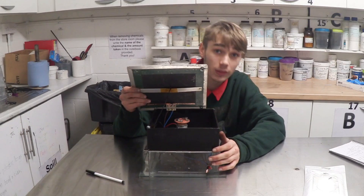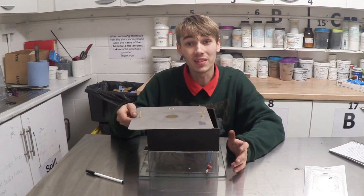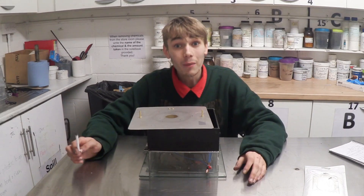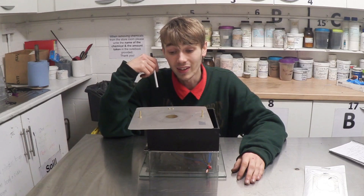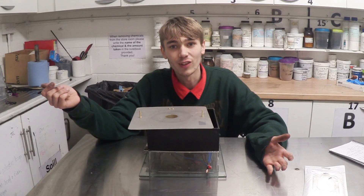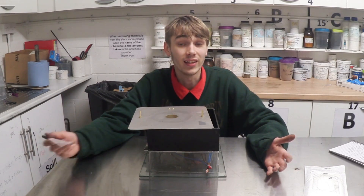That's basically what the heat plate looks like. All it's made out of is a couple of pieces of copper tape and a little bit of resistive ink. Bear in mind that this can heat up to 120 degrees pretty quickly, because it's a resistive heater and they have something like 99% efficiency of converting electricity to heat.